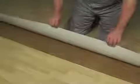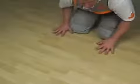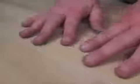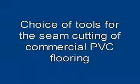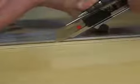To achieve a nearly invisible seam using the Werner-Müller PVC cold welding system, a closely cut seam is required. This can be done by using the double cut technique. The floor covering should be overlapped, with the PVC floor layers overlapping between 3 and 5 centimeters.